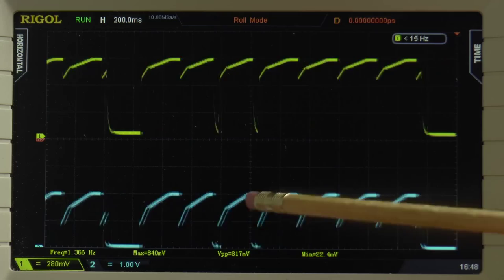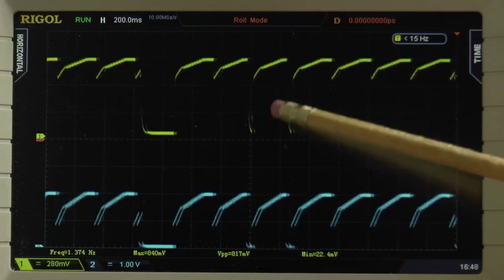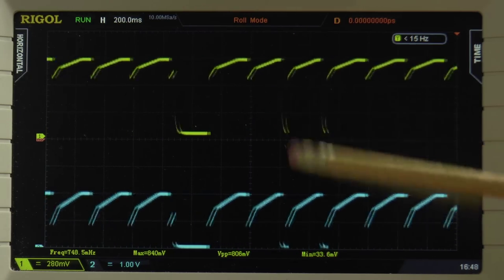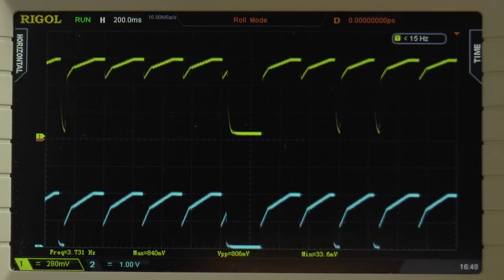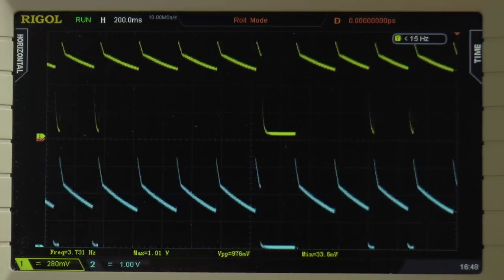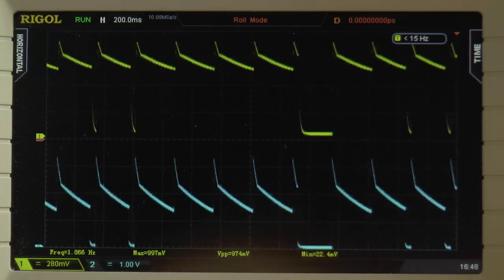And those are kind of errors in the DAC, pulse width modulation circuitry. And you'll notice that our 2.2 microfarads across that gets rid of those little spiky errors as well. So now we'll go back to the sharp attack one more time. And now for the final change, I'm going to switch in that 10 microfarad.